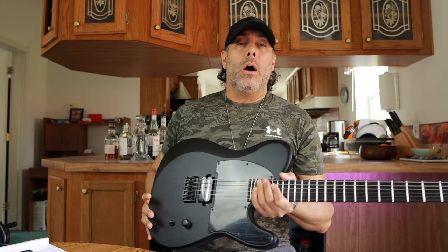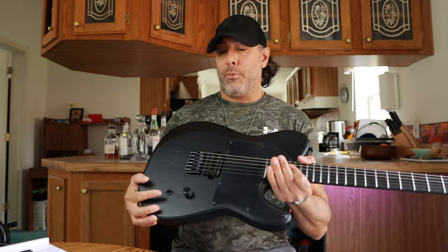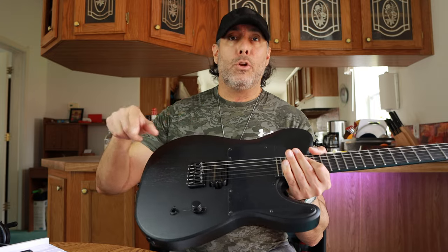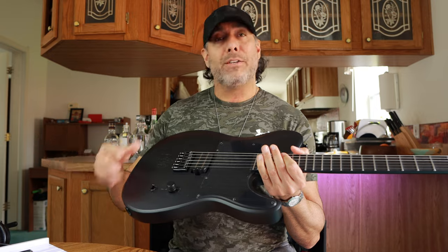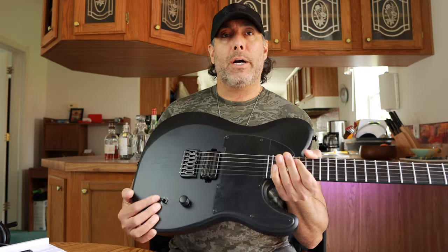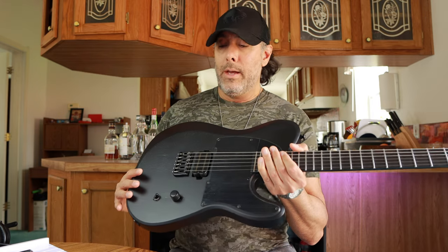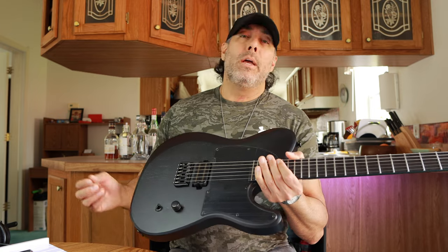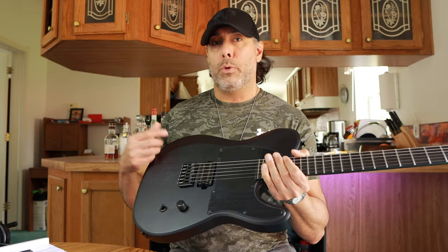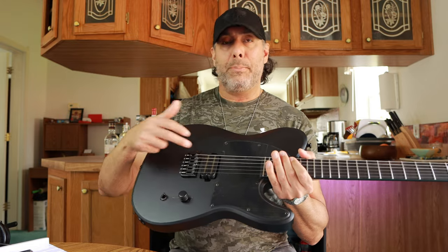I still wanted to do a demo review with the guitar, so I began to write a new demo track for this video. But then I noticed that voicing three — this is the Fishman Fluence Modern Open Core pickup, which is one of the newer offerings from Fishman — it has three voicings instead of just two, with a little toggle switch for voice one, two, three. For whatever reason, the third voicing is so quiet, the output is so low that you can barely hear it. I noticed when I was using a noise gate on one of my amp sims that it wouldn't come through at all. So I think there's a wiring issue, either internally in the guitar or with the pickup itself.